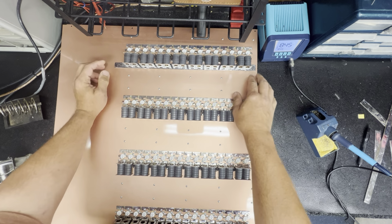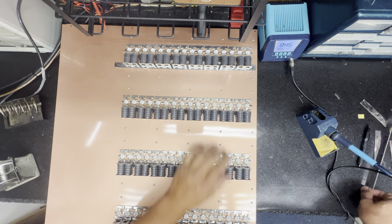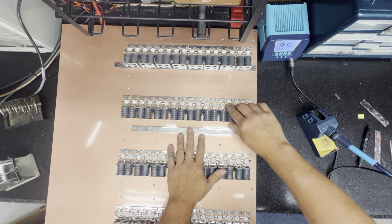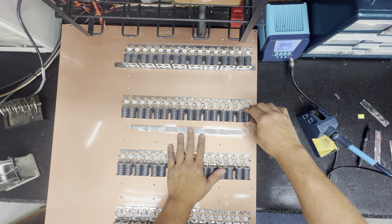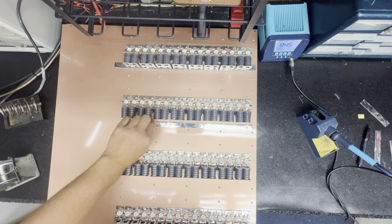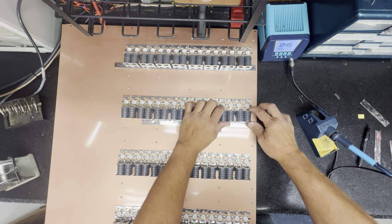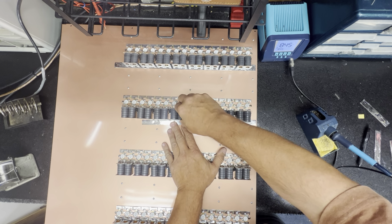when you put it like this, your transformer is not sitting on the board. When everybody leaves their transformers on the board like this, there's a chance of a short right here that burns their amplifier up. You see what I'm saying? Because it's just sitting right there on the board. A lot of people are putting feet on them, but you don't have to put feet on them if you do this. And another thing it does, check this out, is it saves wire and flux and iron.